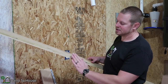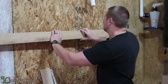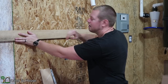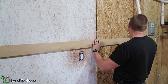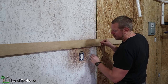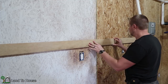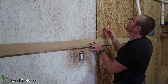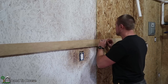I'm anticipating these shelves holding a decent bit of weight, so I'm going to start this just above where my oversized plate covers are going to be. I can tell where my studs are because I have screws from holding the sheathing on. So I'm going to get one screw in here.